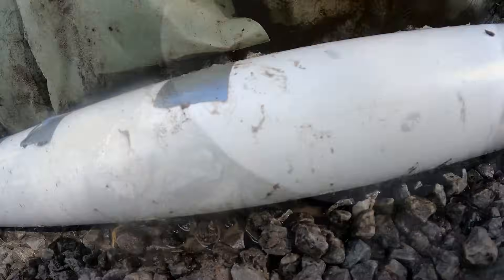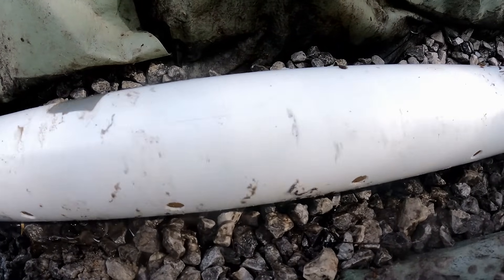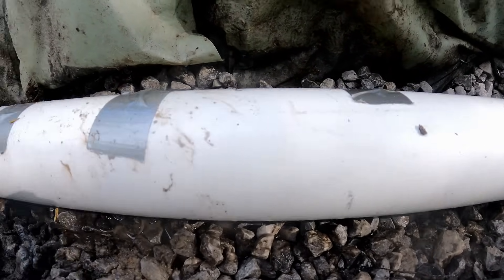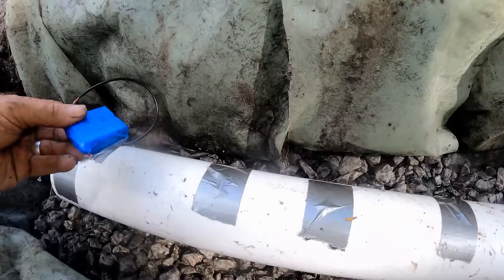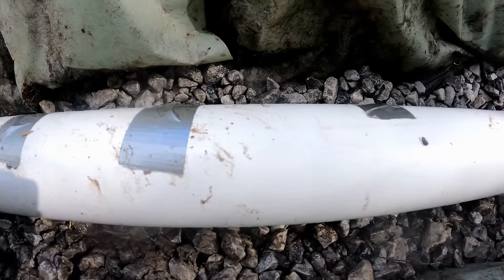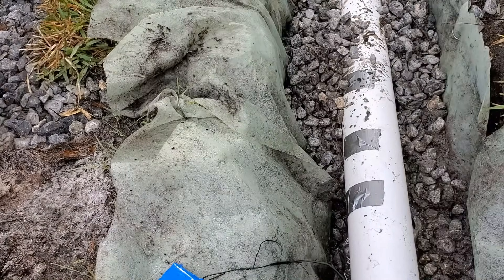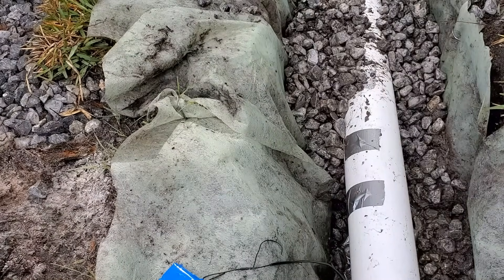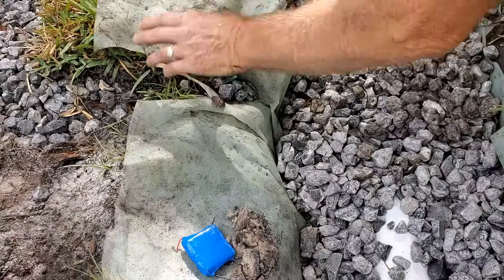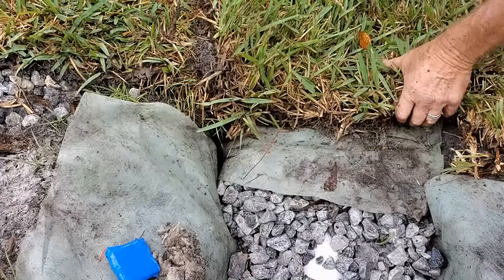When you're running PVC pipe for your French drain, you'll notice there are holes on the bottom — make sure these holes point down into that base of gravel. So we've got perforated pipe, holes pointing down into the trench. I've got my battery and lights set up inside. Now we cover the pipe with gravel, fold the fabric back over the top and pin it, and finally we will add the sod.